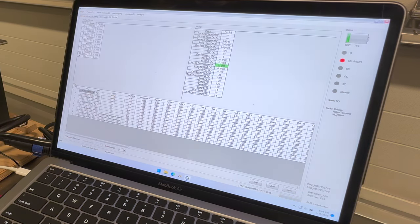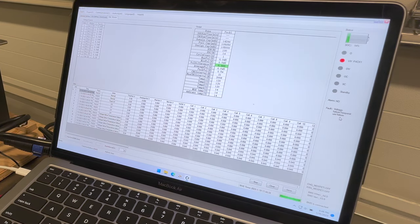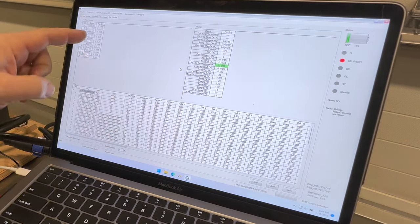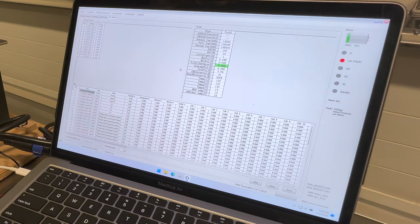Our state of charge is 14%. We have a fault over here — voltage failure and temperature failure. I don't know if that means the sensor is broken or has become disconnected. But it looks like I was on the right track: the battery is shutting down because it thinks the temperature is not correct, and I believe it's a sensor problem within the battery. One strange thing — if we look at the cell voltages, each one is only a fraction of a volt: 0.045 volts. All of them are reading the same, which is really really low for a lithium battery and doesn't make sense at 14% state of charge. So maybe there's more wrong with the battery than just a faulty temperature sensor.